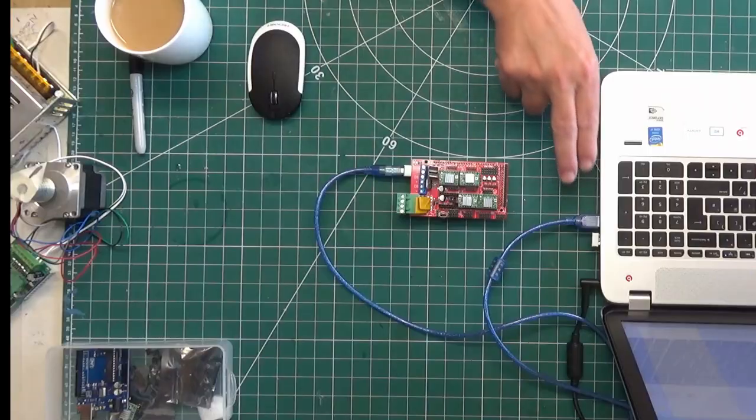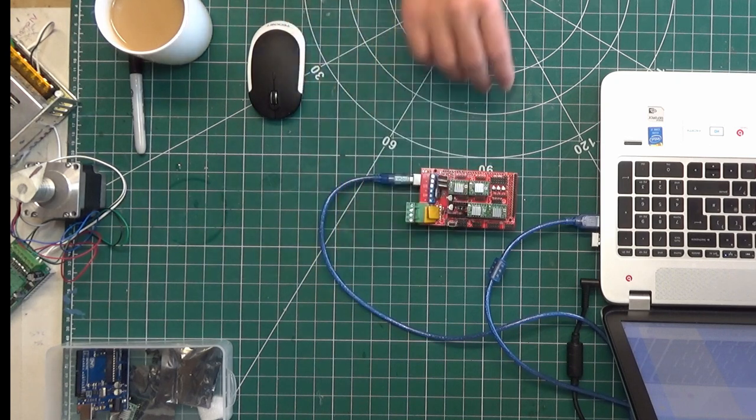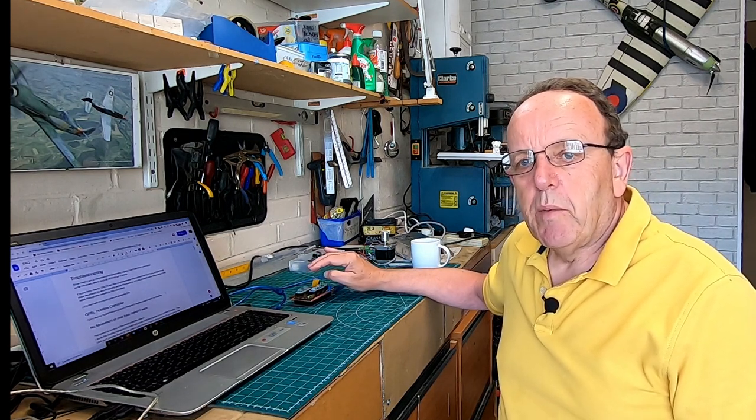We'll start with probably the most common issue: one or all of the axes not working. The first thing to make sure is that you've got enough power for the RAMPS board. The USB cable that goes in the side just isn't enough to power this board with all the drivers on there. If you're using motors rated about 1.5 amps and you've got four of them, that's six amps, plus about an amp for the RAMPS board itself — so seven amps, or about 84 watts minimum.